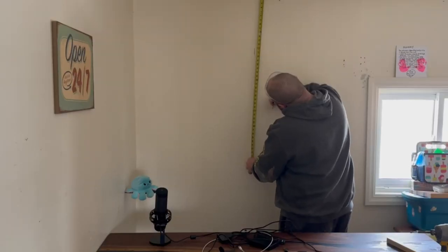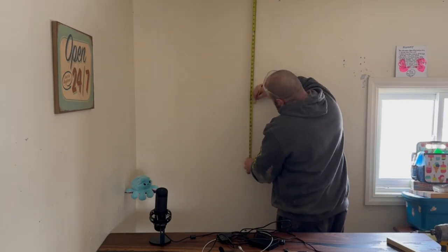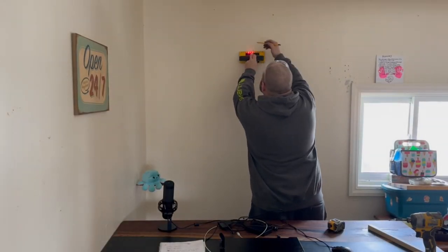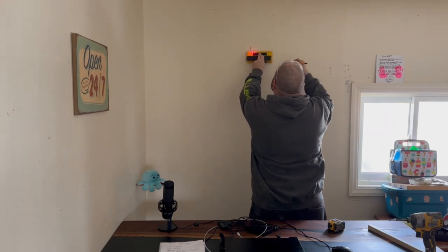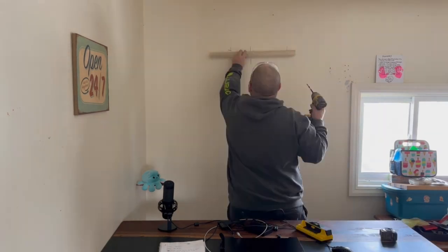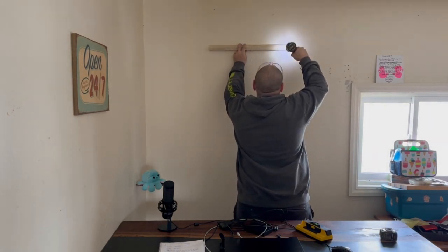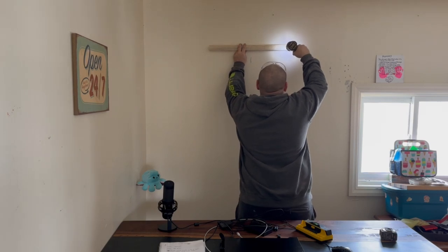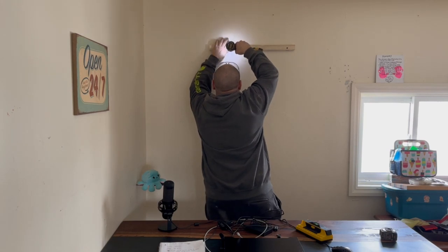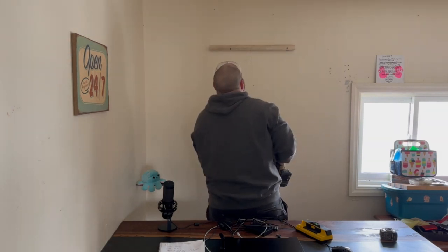Now I'm in my office, just trying to find the center of where I want this to land and marking out a couple of marks. I'm going to use a stud finder to find the studs because we definitely want to hang this into studs — this piece is a little too heavy for wall anchors. Then I'm mounting my French cleat on the line I've marked, with the angle angling out so the piece on the back of my art can hook onto it and sit nice and firmly and secure.